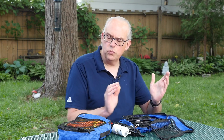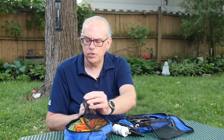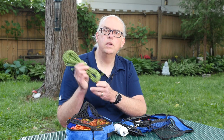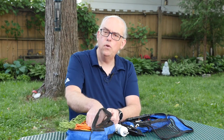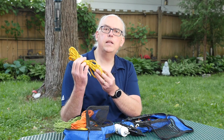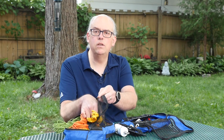Coax is not included, and neither is rope. You're going to need an appropriate length of coaxial cable, 50 feet of lightweight line for deploying the antenna in a tree and hoisting it up, and then four 25-foot lengths of lightweight line, like paracord, for securing the ends of the elements.